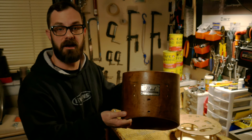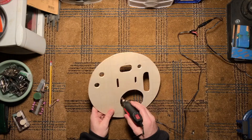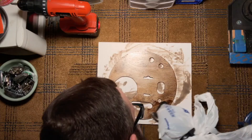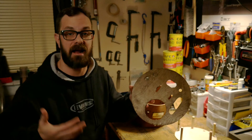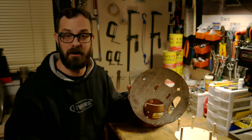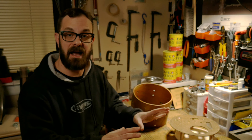Well, we have reached the end. All the pieces are done, prepped and ready, and we are ready for final assembly. The shell is all done with the finish nice and sanded, and it's been sitting for a couple of days so it's nicely cured. The top plate is all done too — I had to do quite a bit of fine sanding with my Dremel tool to get all the edges nice and round so it doesn't scratch the phone or anything going in this accessory carrier. I've gone ahead and stained it using Minwax stain from the local hardware store — just rubbed it on with a rag, made sure all the spots were nicely soaked in, and it's cured for about a day. Now let's jump into final assembly — starting with putting the lugs back on the drum.